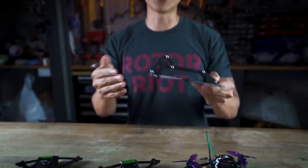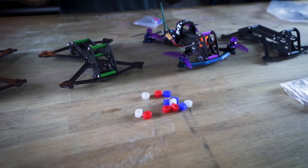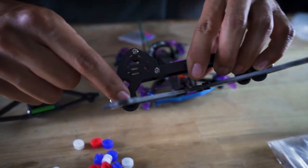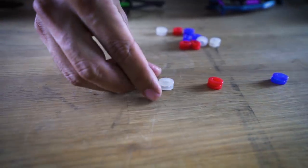This features a custom proprietary bushing. We started with off-the-shelf grommets from a hobby or computer store, saw a mild improvement, then experimented with thickness and size. We also made them in varying shore hardnesses to find the rating that mitigates jello best. We have black ones rated at 70, blue at 60, red at 50, and clear/white at 40. The lower the number, the softer the material.